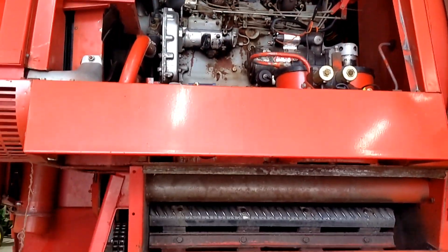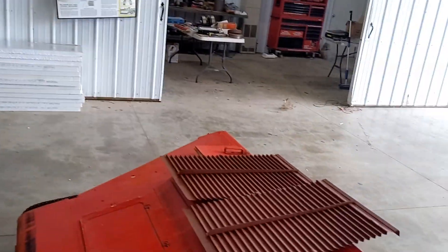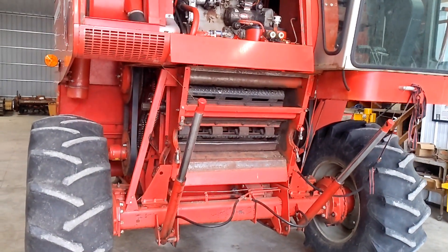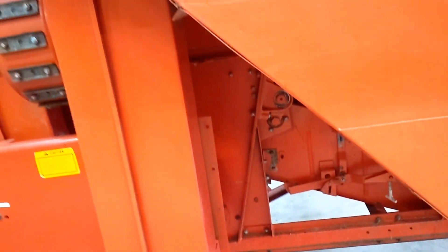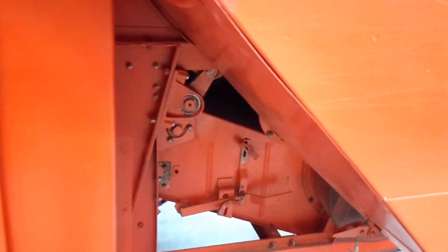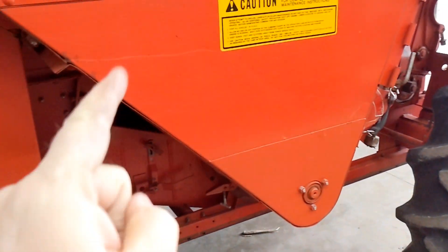The combine has been cleaned and we are going to put the pans back in. I did not have a lot of loss leaking on the combine. I do want to make some sheet metal pieces to seal up this area right here where the cleaning sheet blows into the sieves on both sides. I'm suspecting the grain pan is moving to the sieve in its shaking pattern and there might be some pinholes in there - though there was never any corn in that area, or that would have been a major problem to address.